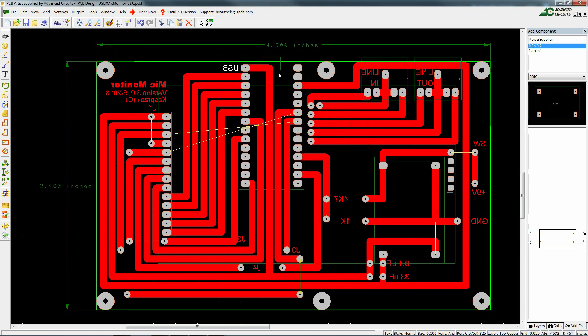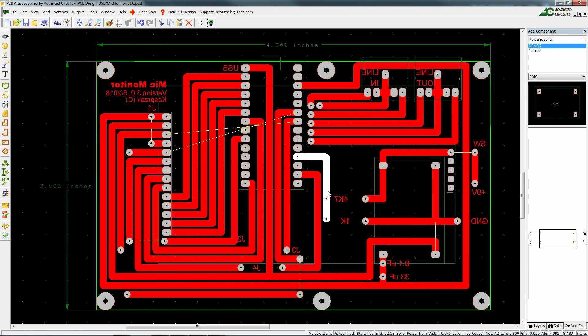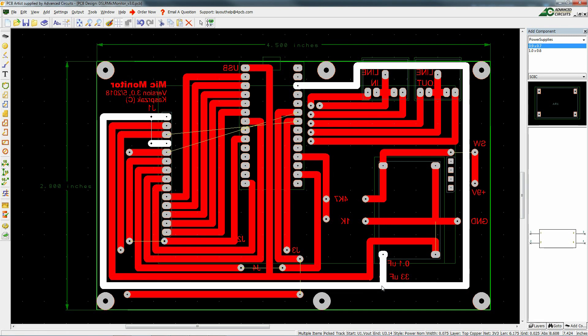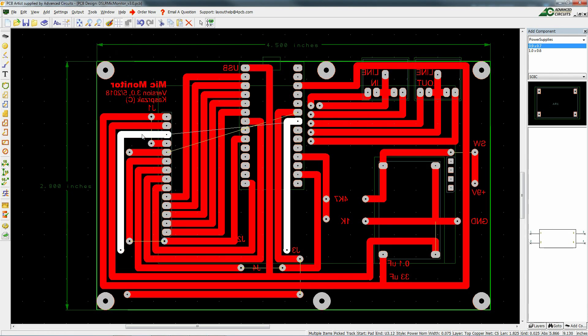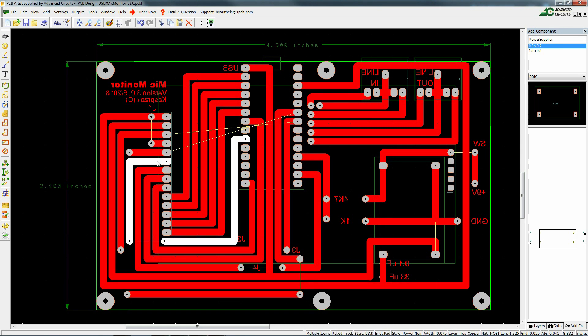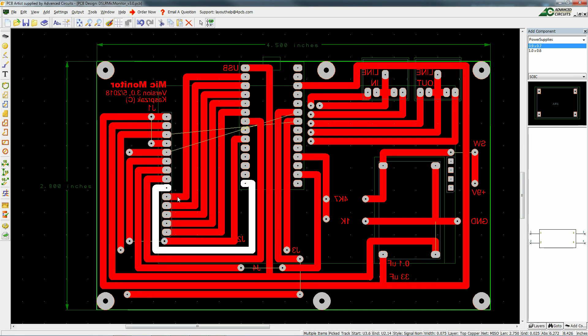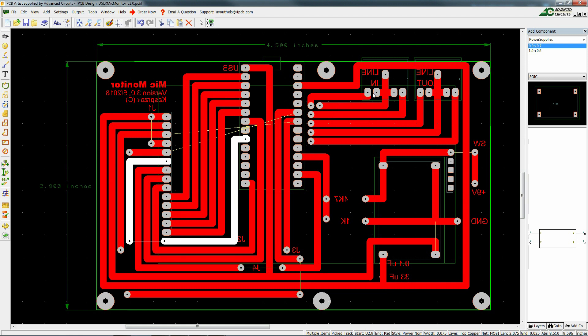For PCB construction, I'm using something called PCB Artist. It's a free download from the web, and I've actually designed this circuit board using brute force — I don't have a schematic that I went from; I just laid components out and started routing things around. Since I'm doing single-layer board construction only, I will have to install some jumpers. A handy probe tool lets us see where the connections go to make sure we have everything connected correctly. I did build up my own set of libraries for the Teensy, the display, and a few other components, so when I place the components into the design, it gives me a preview of where things should get connected. Then it's a matter of connecting things up and routing them to get the most efficient traces.